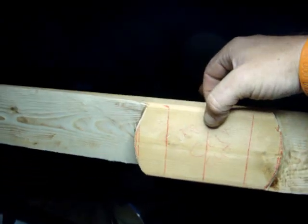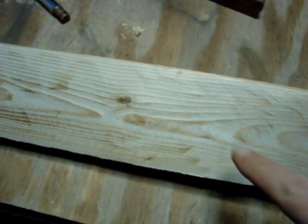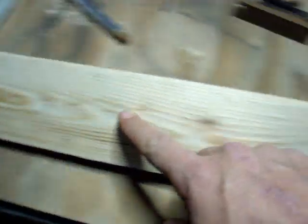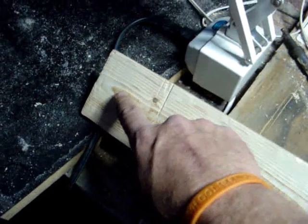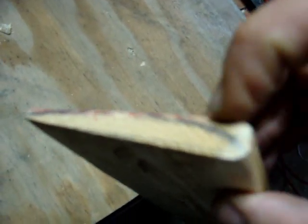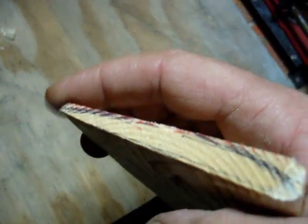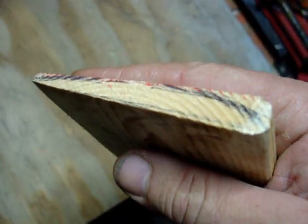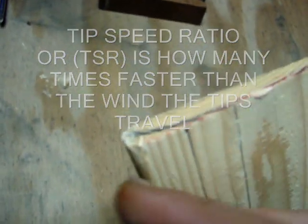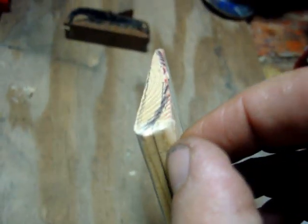If it balances, that does pretty good. If it goes to one side, take some out of the middle - right down in here. The farther out you take off on the end, the faster it's going to change your balance. Taking a lot out in here will equal just a little taking it out out here. Let me show you the other end - I actually drew the Venturi curve there. This is the flat side and you can see the line of the curve. From this point up here down to here, three degrees - that'll give you a 4.5 tip speed ratio.